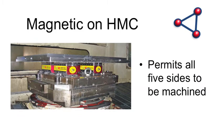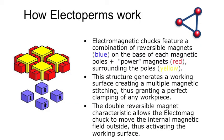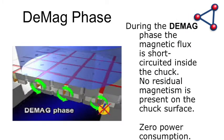You may need something more permanent — an electroperm system. Electroperm magnets are wonderful because once you turn them on they are on forever. How they work: you're either putting the flux line through the top or through the bottom. That's important because people ask, 'If I lose power, will I lose holding force?' No — you've changed the flux line. You'll lose some residual magnetism, but the part will retain holding essentially permanently. There is a mag and de-mag cycle — it's reversing the polarity.